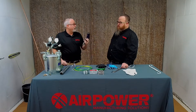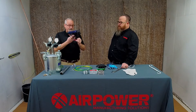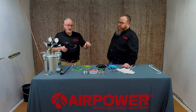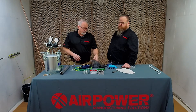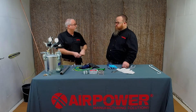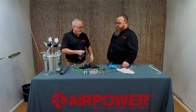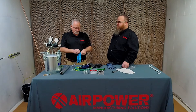What happens if I'm spraying with an electrostatic gun, whether liquid or powder — how is the operator grounded? This is a black plastic composite material that is groundable. We have a groundable air hose that would go on here. If I'm the operator and I put on gloves like these that you see in every facility, am I grounded? No, we are not grounded. What if I use one of the nitrile gloves? Am I grounded with one of these?